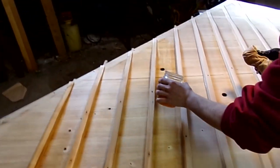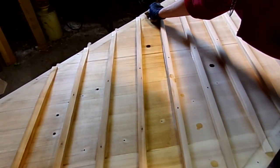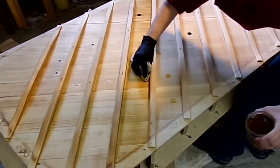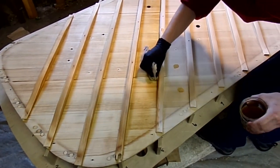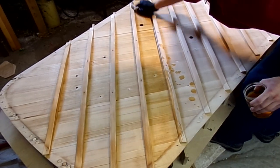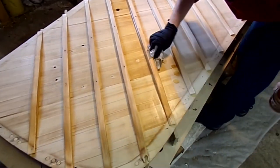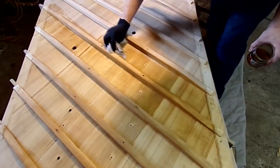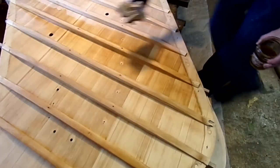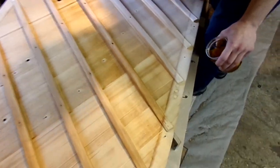One of my previous videos doing this, we were emphasizing the fact that we just can't leave drips behind because they give you troubles later on. And a very, very thin wash coat of shellac. We're going to do it again and add some to the solution to make it a little thicker, a little more body. But this soaks right in all the cracks and corners, especially in the corners. And it doesn't affect our glue joint. It's so thin. From past experiences, never had any problems.